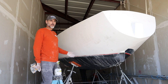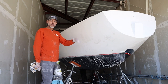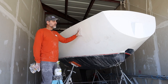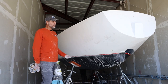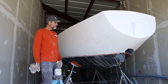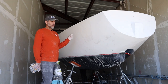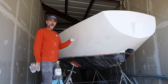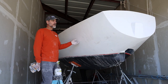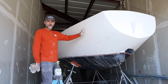This is used a lot in automotive — if you have damage on a car, after the repair it's not flat, it's kind of wavy. So you float it and then sand by hand with a long board, which gives you a really flat surface. That's what I've done here with the high-build primer. After getting it to 400 grit, I put six coats of Alex Seal stark white paint on. I went with six coats because you roll it fairly thin — you mix the paint thin to get it to flow out really flat — so I needed to build up thickness to have room to come back and wet sand and polish.